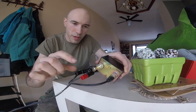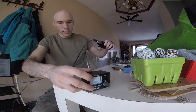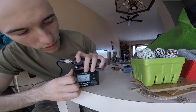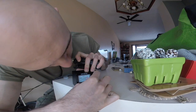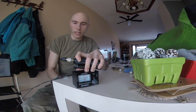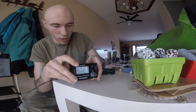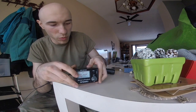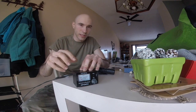Now testing the jungle antenna using the banana cobra head adapter wired up to it. Going through the same process — forward mode, transmit, rotate to set — and the jungle antenna measured about three and a half. So the SWR is actually worse with the jungle antenna, which isn't surprising given the 18 gauge wire and improperly matched impedance. The real advantage of this antenna isn't a better SWR, but that you can raise it high and get a good vantage point since it's omnidirectional.